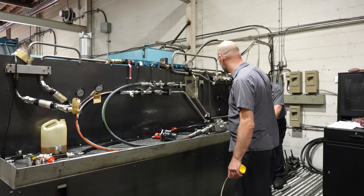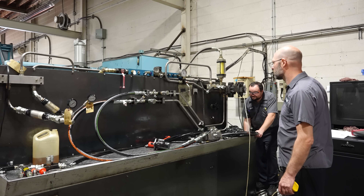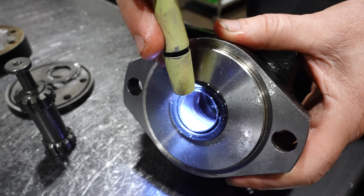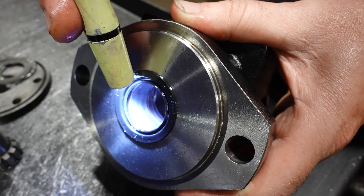So there we have it — the problem was contamination, one of the most common problems with hydraulic systems. I would say 80 to 90% of all hydraulic problems with their components are related to dirty oil. Often when you have this type of contamination it can be very destructive, particularly in gear type motors and pumps — they do not handle contamination very well. But in this case, the motor is perfectly fine. It just needs a new shaft seal. If you want to see how a low speed high torque motor generates such great torque, there's a video on our channel.